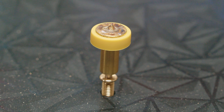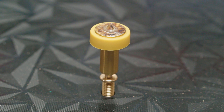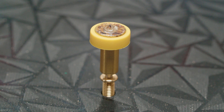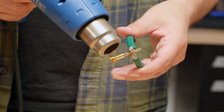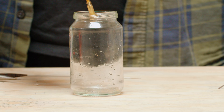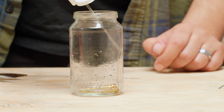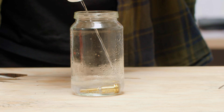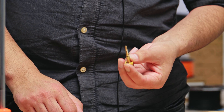Let's put this into practice. I have here a 0.25mm Revo nozzle which is blocked. I can't use the acupuncture needle at the tip because it's too small, and the nozzle and heat break are integrated, which may compound the problem. Using the rod, I find it can't be pushed deep in, so the issue is at least with the heat break. A cold pull probably won't work here, so let's try the heat gun. If that still hasn't worked, we'll use the solvent approach — dip it in, wait for it to dissolve, poke with the rod to check if it's softer, let the solvent evaporate, then reinstall and heat up.